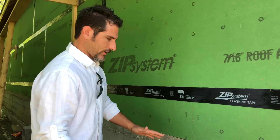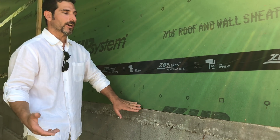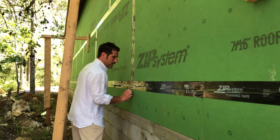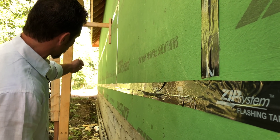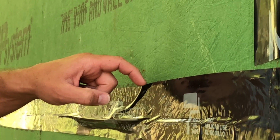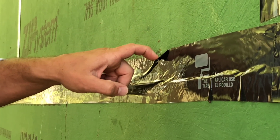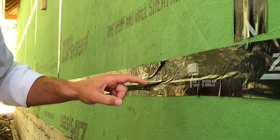ZIP tells you that you're supposed to tape this bottom, but they obviously haven't done that here, and I very rarely — I can't actually think of any homes I've seen that done on in our area. Again, on the sides here we have some really good examples of improper tape methods. If you come over here and take a look, there are bubbles and wrinkles in this tape all the way down this wall system. When we take this system apart, you can see this one here is bubbled right across the top edge of the tape. Water that hits the ZIP system comes down and this bubble becomes an actual funnel — there's a seam here — so the water that gets funneled into this tape can't go anywhere but into the home.